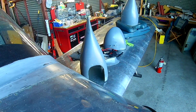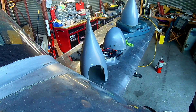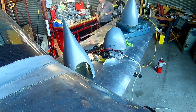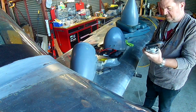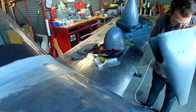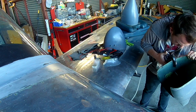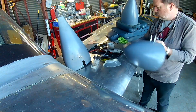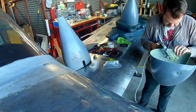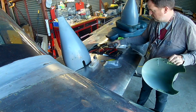Hi everybody. I want to apologize to my photosensitive and epileptic viewers who I may have just sent into a seizure. In the last video we finished epoxying up the gear leg transition pieces — basically those are the ones that attach and hold the gear legs in place to the fuselage and the wheel pants. You add a nice layer of floxed-up epoxy to the feet of them and snug them into place, and let that epoxy harden so they have a nice perfectly flush fit.